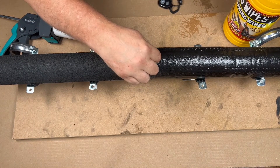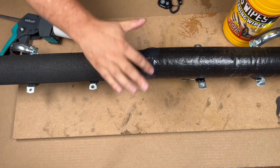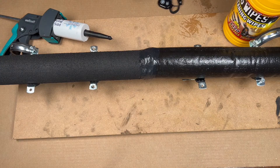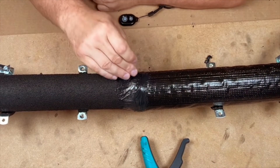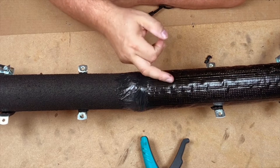You can see we've sealed inside, put the bond and seal on this side, and flanged it onto that side to make like a cap so no moisture can get in. It can also expand and contract. Leave that for 24 hours — and 24 hours later you've got a perfect seal: no energy can be lost and no water can get in to degrade the insulation.